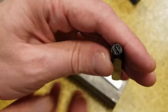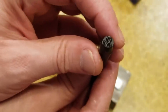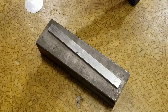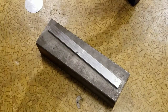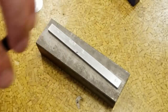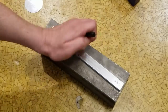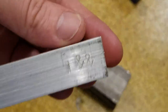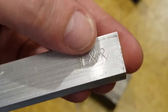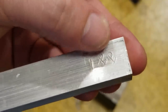Another dynamic to these is a character like the ampersand has a lot of material — it's going to take more force to drive it the same depth in aluminum compared to, say, the letter I, which is just a line. This little line is really easy to go way too deep — just like that. It's much, much deeper, and I hit it not nearly as hard.